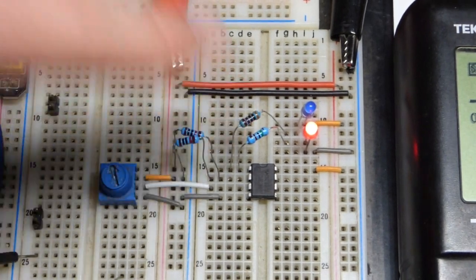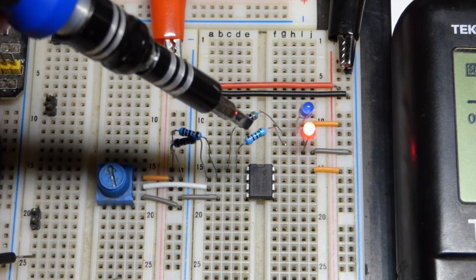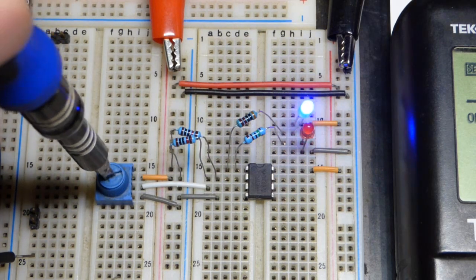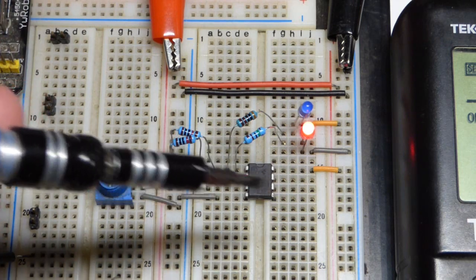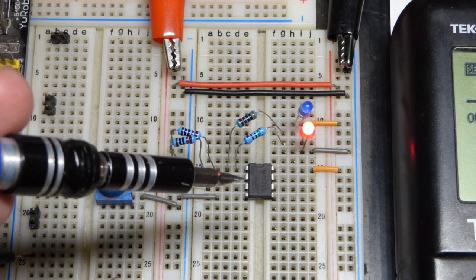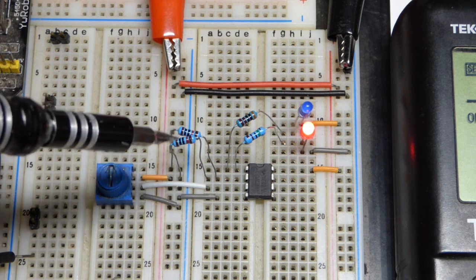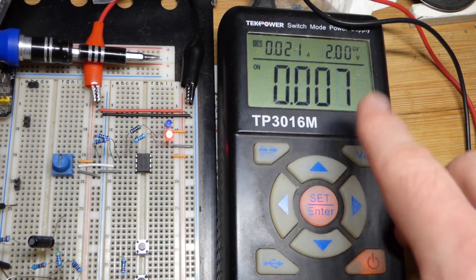You can adjust the resistor values if you want, but if we go up to 14 volts, 14.6, I think you really want that 1.5K right there. So the red LED will get brighter as we bump up the voltage. So there's an op amp there, but we're not using it. Same pin layout though as this one, other than it shuffled down. So output, inverting input, negative, and then the non-inverting input, the plus, right below that. So trim pot, fixed resistors of equal value, doesn't matter their exact value, and then the output going to the load. And now we will change the supply voltage.